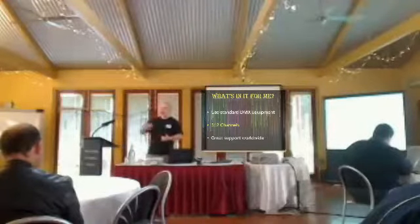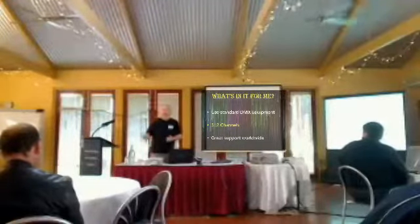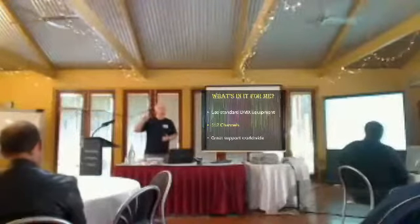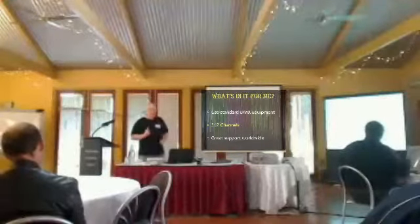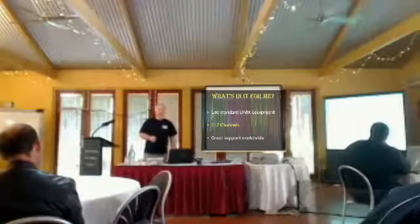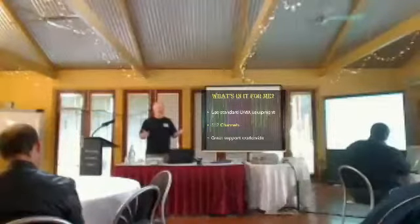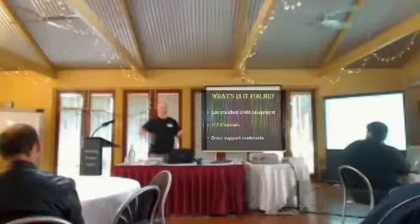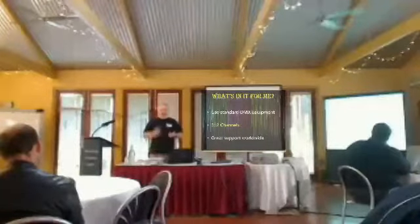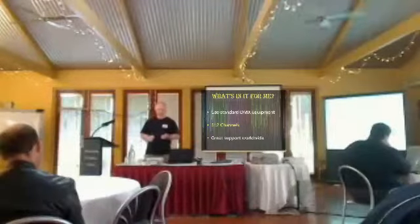The data going out on that universe of channels is constantly repeated. As I said, there's a standard. That data has a minimum refresh rate of 1 second. Every second it must be refreshed by the standard. Normally, these hardware devices will refresh it 40 times a second. So if you drop a packet of DMX from the controller, 25 milliseconds later, bang, there's a new set of data. So you might see a very brief flicker in your lights, but unlikely.